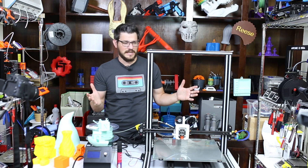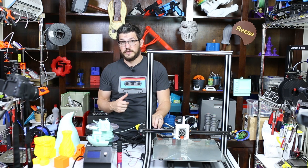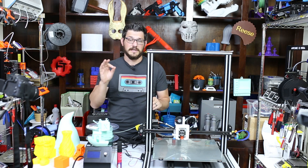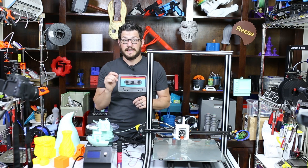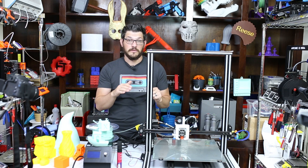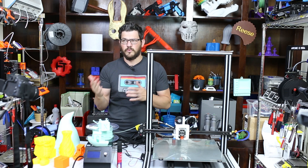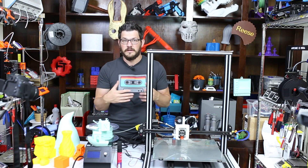This is an enormous build size so it really makes sense to use a larger diameter nozzle. I was having issues with this extruder originally but I just did not have things tuned quite well enough. I went ahead and tuned E-steps a little bit more, calibrated my temperature a little bit more, and found that in order to print at 40 millimeters a second I needed to have standard PLA at 230 degrees centigrade. For the first layer I had to do it at 210 or 215 because it's going slower, doing about 20 millimeters a second roughly on that first layer.